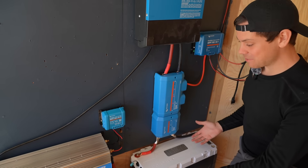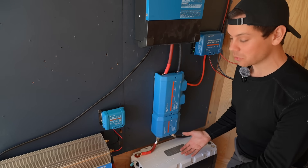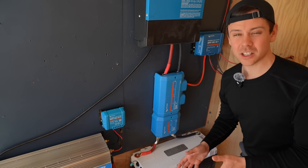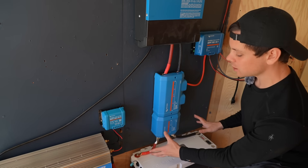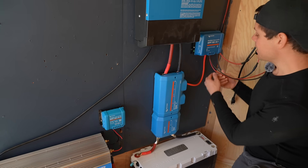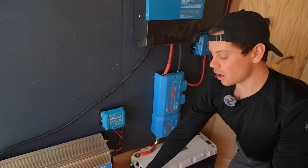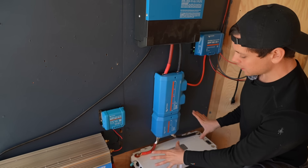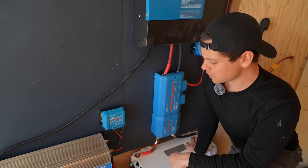That's pretty much it — I don't think it gets easier than this. The hardest part is putting the solar panel somewhere and running the wire all the way over to the controller. A good tip for beginners: do not connect the battery until all of the wiring is done. Then do not connect the solar panels until it's nighttime — that way you're not working with a higher voltage. These 12-volt batteries can't be turned off like a 48-volt battery can, so make sure you connect everything together and then connect the battery last. If you follow those steps, you shouldn't be able to screw this up.